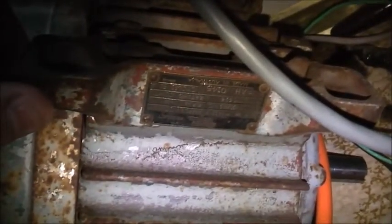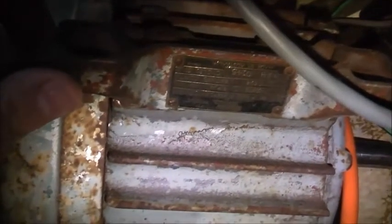This is how this terminal block on this motor looks. That's all your terminal block is - it's not like that, is it. Nice and easy to understand on this one, not so much on the other. What's going on there? I might double-check the nameplate. I don't know if this is actually wired up correctly for a VFD. I couldn't say what connection it is. It might have been wired in Delta - they could be in star then.